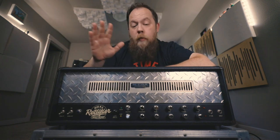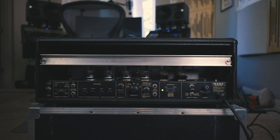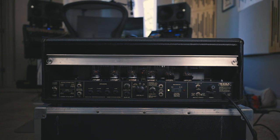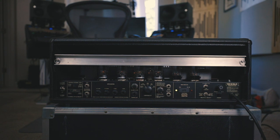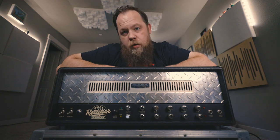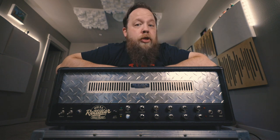They had revisions C, D, E, F, and G — a pretty cool piece of history. I will also note that this is equipped with a set of vintage 12AX7 Shuguang Chinese preamp tubes that I have sourced, which is what would have come stock in this amplifier. There is a set of STR Mesa Boogie 445 power tubes, which are just the JJ 6L6s, and the rectifier tubes are GZ34, for you nerds out there. So let's plug this in and just give it a casual playthrough, shall we?